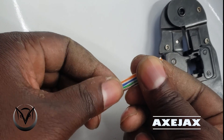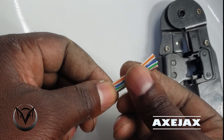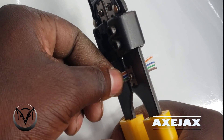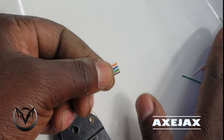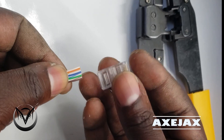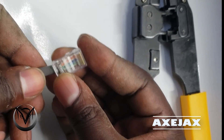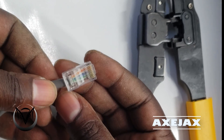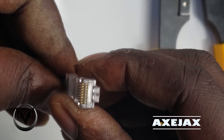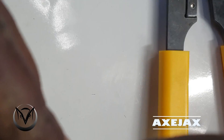For today's demonstration we're going to use the T568B pinout, which is: orange-white, orange, green-white, blue, blue-white, green, brown-white, brown. Make sure that you turn the RJ45 connector upside down so you can see how you're putting the cable — it's easier that way — and make sure you can see the tip of the cables on top of the RJ45 before crimping.